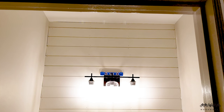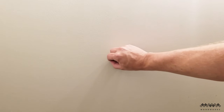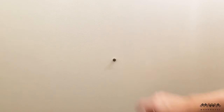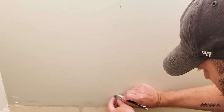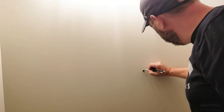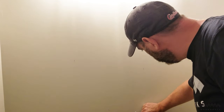Before the install, I wanted to add some shiplap to the wall behind the vanity. The first thing I did was locate the studs — this is really easy if you have a magnet. I just run the magnet along the wall until it sticks, which means I've located a drywall screw and the stud is right there. You can mark along each stud by locating more screws, then measure over 16 inches and search that area for the next stud. This is a cheap and simple way to locate studs if you don't have a stud finder.